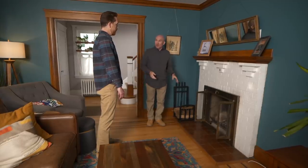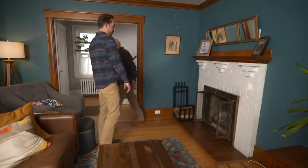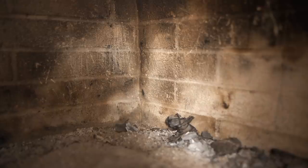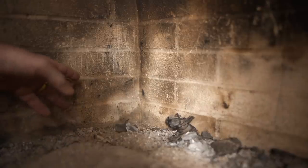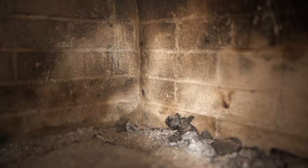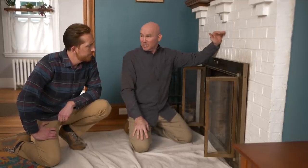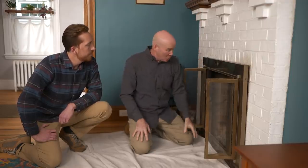To be honest with you, the first thing I see is something that's good. So I'm actually going to grab a drop cloth, we'll spread it out and we'll check out what you have. I've actually seen a couple of good things. You can see this back wall, this burn pattern — you see how it goes into a semi-circle just like that? That tells me the fire is burning at its hottest down low, which is what it's supposed to be. It's about 800 to 1200 degrees down here. As you get up here, it's about 600, and by the time this smoke gets out of your chimney at the top, it's just hot air.